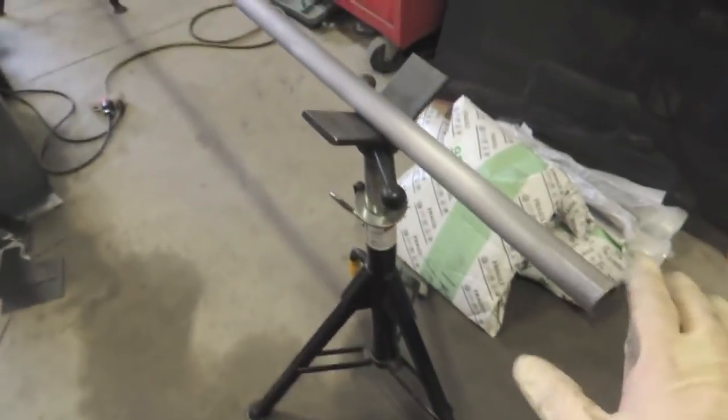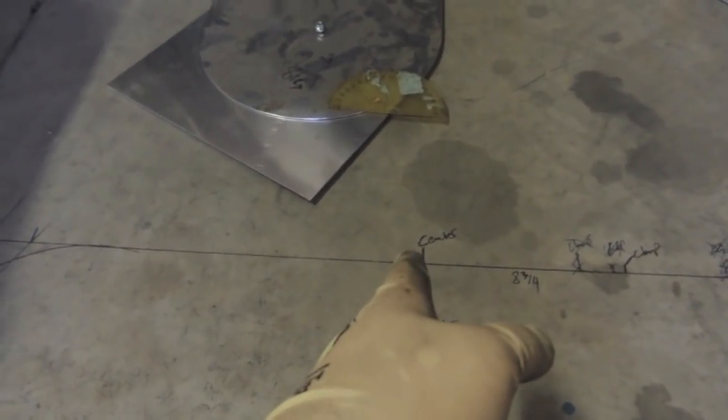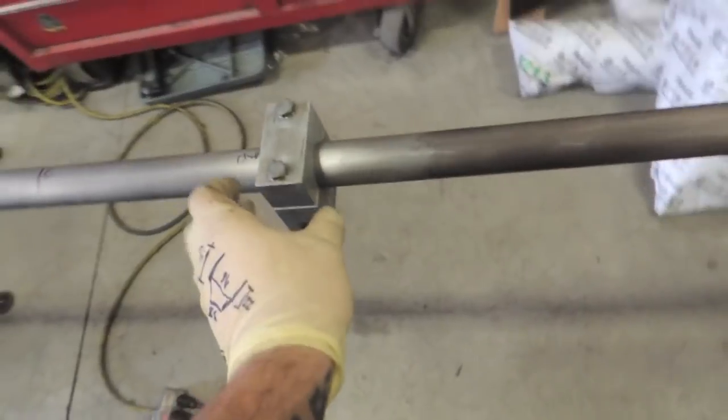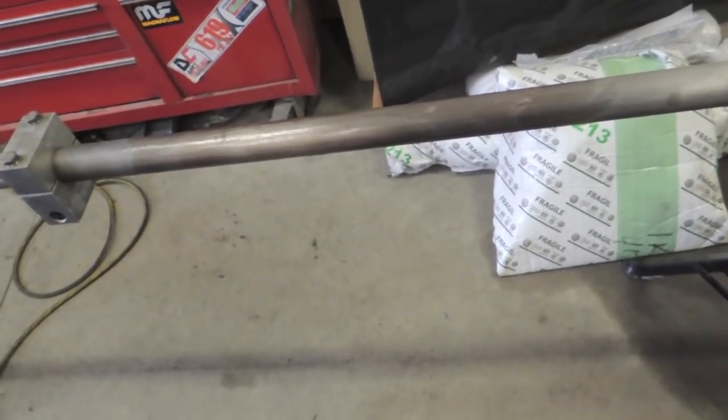I have my main hoop bar cut and prepped — sanded with 80 grit to knock the mill scale off and cleaned with non-chlorinated brake cleaner. I work off a center mark, so this is the center of the main hoop. I'll divide the tube in half — it ended up being 10 feet — and put a mark at five feet for center, working out from there. The measurement from centerline to the clamp is eight and three-quarters. I always grease the tube, especially on bends over about 20 degrees; without grease it'll have a tendency to buckle, fold, or kink.